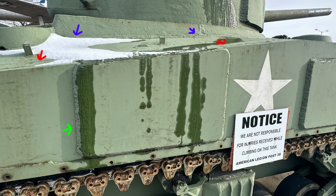Now, as far as the other welds in here, again, the top of that plate on the side where it's red arrows, that's subarc, and the blue arrows near the top, that I believe is stick welded. I had to look at that in the pictures pretty good because in person people start getting suspicious when you're climbing on stuff like this trying to get pictures. But I believe that whole top area at the bottom of the turret was stick welded. For one, the subarc machine would probably be pretty hard to get in on that kind of an angle. Maybe it's doable, but there appeared to be too many starts and stops, and the beads just looked a little bit different. So I believe that was stick welded with probably 3/16 rods, so big, 2, 3, 400 amp plus rods that you're running on that.